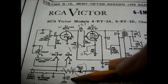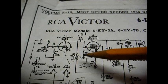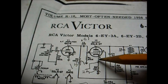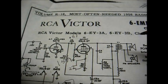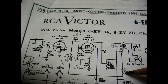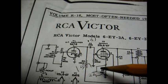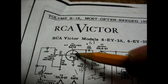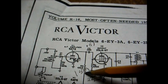Our chassis isolation cap — in this case originally a .1 — I went with a .01. I originally had a 22-microfarad cathode bypass capacitor on the audio output tube, but it gave us a little too much gain, so I took it out. The resistor across the filter capacitors is 1500 ohm in the original — I used 1000 ohm. The value is really not that critical, but that's what I had in stock.